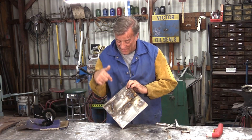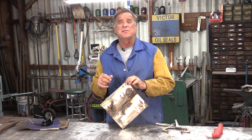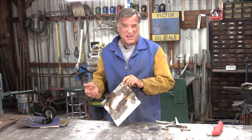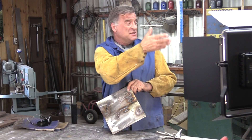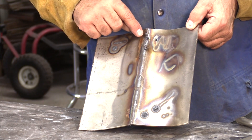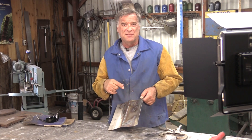What I've got here is just a piece of stainless steel — I think it's like 308. I've been practicing on it, doing little welds on it, and other people have practiced on it too. Let's just take the gouging function on this Everlast Power Plasma 62i and gouge this whole weld out on the back side. Just remember, the idea behind gouging is you want to remove the weld — you don't necessarily want to blow all the way through the metal. You're not cutting, you're just removing a little bit off the top. Let me put the rest of my gear on, fire the machine up, and see how I do.